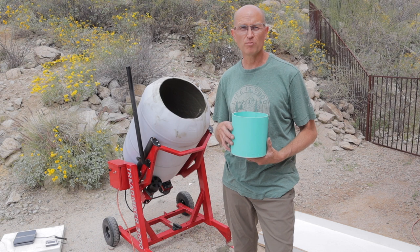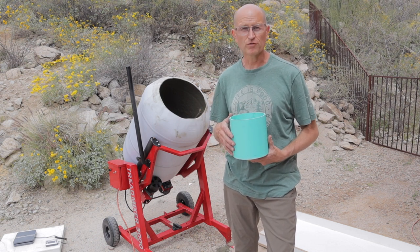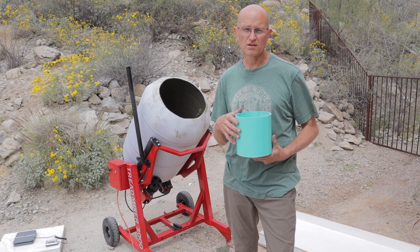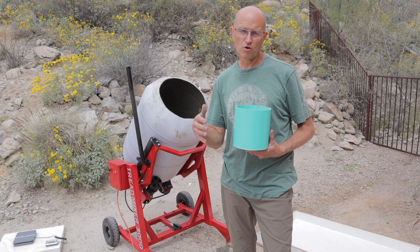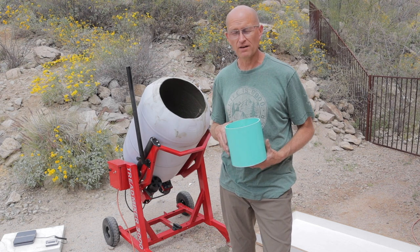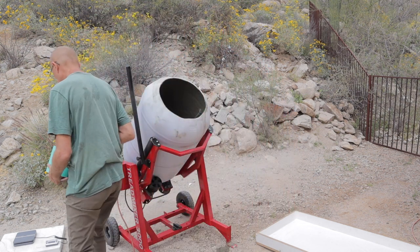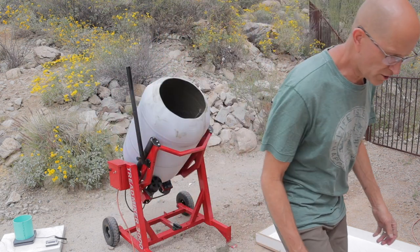That way, you know what density you're pouring each time. If you need more foam or less foam, you adjust it by putting either more foam in or less — with a little more concrete and a little more water. It's better off to have it lower and then add more foam to bring it up to exactly the density you want. I just have a little postal scale set up, and I set it down and take a bucket of cellular concrete.